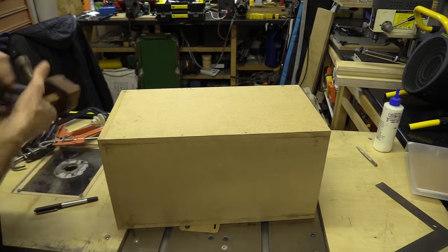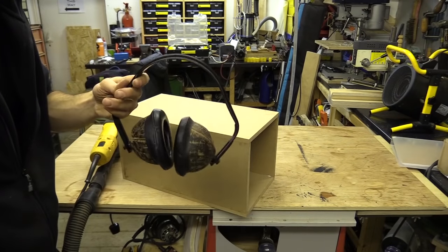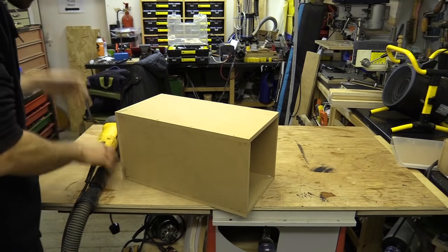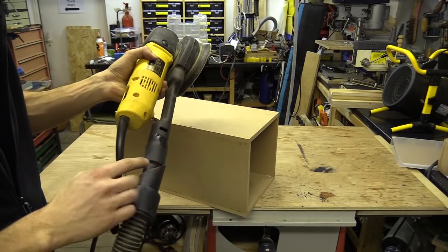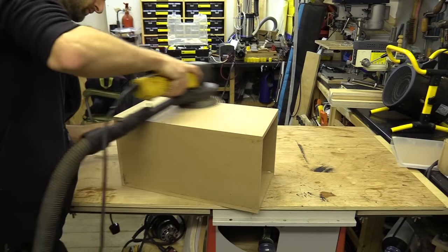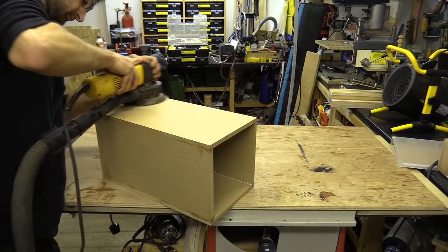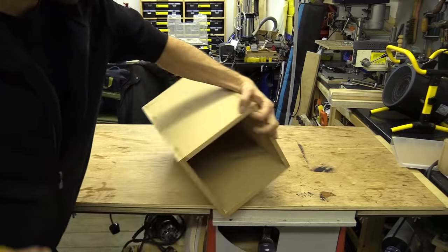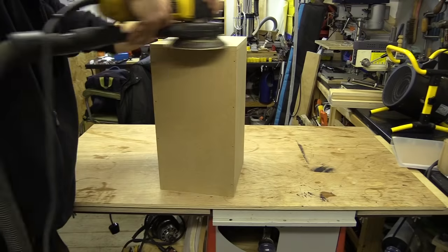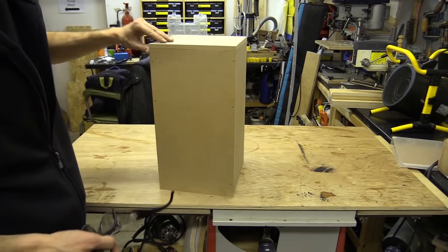Now put your tools away. I'm going to sand the box — it won't take very long. Make sure you're wearing goggles and ear defenders when doing this, and I've got the sander on an extractor with 80 grit paper. You can also use a flush trim bit on a router instead of sanding, but if you're careful when assembling you won't need to do much of either. That's how to make a pedestal, plinth, podium or box. If you were making a podium you'd do it the same way, adding timber or additional panels inside to help distribute weight and reinforce the joints. In the next video I'll show you how to paint it.